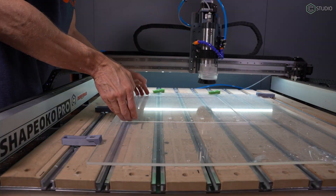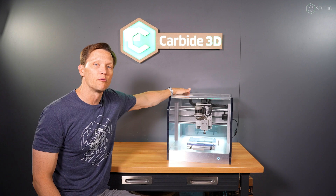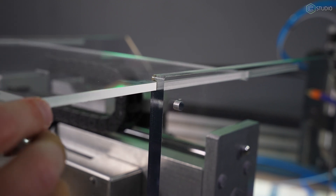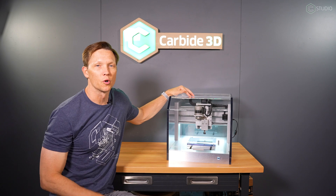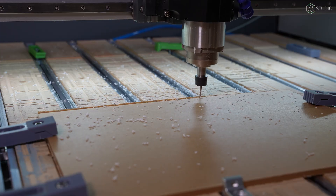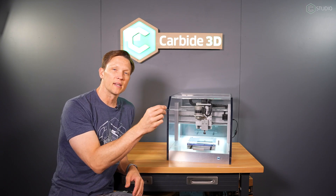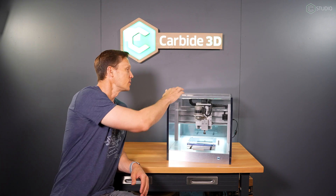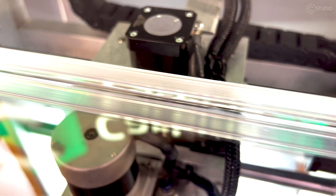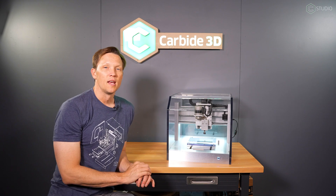The top of this machine is normally a one-eighth-inch-thick piece of material with rubber sides. I changed it to a full quarter-inch so that it would slide right into the existing slot and give exact fitment. Once you change the top from one-eighth to one-quarter material, the hinge is no longer going to fit. So I had to take the hinge and actually inset it into the top quarter-inch material — flip-machine it, locate it exactly, and cut the pocket on the other side to narrow it in to exactly the middle of that top sheet. I didn't want it on the top or the bottom; I wanted it exactly in the middle, where it would normally be, so the door would have the same relationship to the floor of the machine.